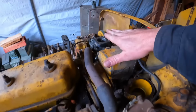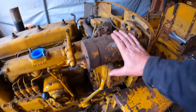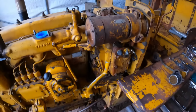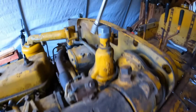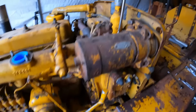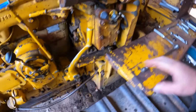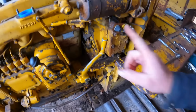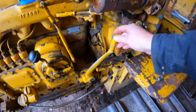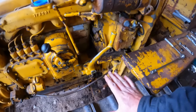And I know I'm a bit biased, but you'd never convince me that a direct electric start system is better than a properly functioning pony start. And that ties into the fact that, yes, that pinion drive is difficult to access, but the reason why they seem to always need attention is a cumulative effect of years and years of people basically having abused the system because they don't really understand how it's supposed to work. You'd be surprised how many people I've talked to that don't realize you take the clutch lever and pull it to the rear, that actuates a brake. They did not even know that was a thing.